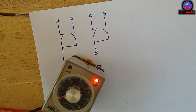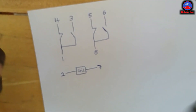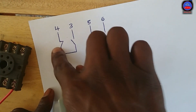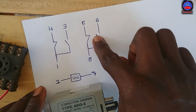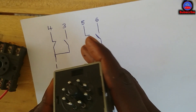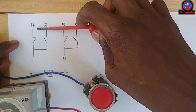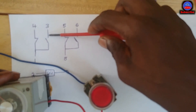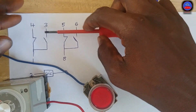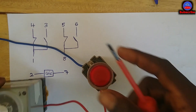So this is a simple on-delay timer. It has two sets of contacts. This side is a normal relay contact — as soon as the timer energizes it changes state immediately. The other is the timing contact — it only changes state when the preset time is reached and finished. I have now connected an indicator light at pin 3 to test this side.